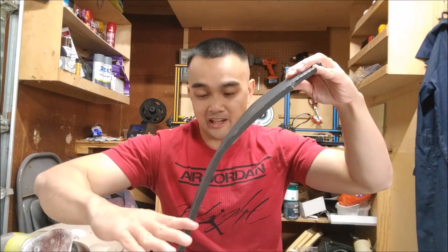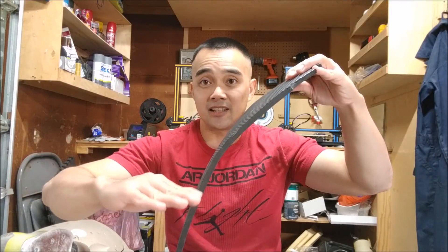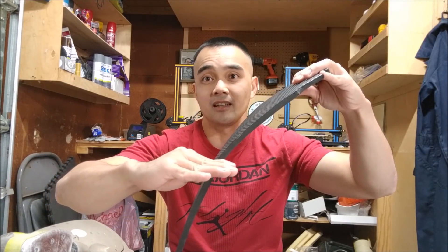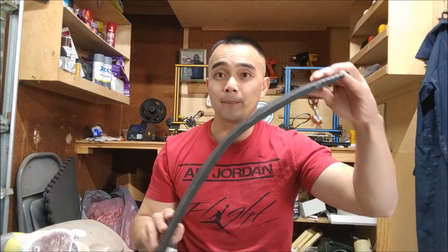Because the layers that you've put down — the next layer can sit on that layer, and this is going to sit on each layer as it goes up. So that's it for orientation. Just think of a flower blooming — you have to build it up, just like this. If there are any overhangs, it's going to need support. If the plane is flat and parallel to the build plate, it's going to need support.